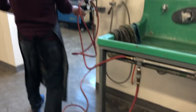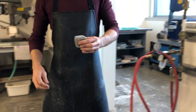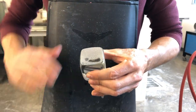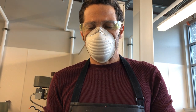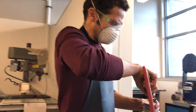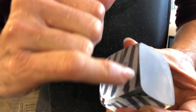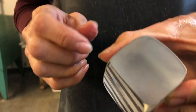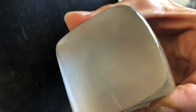I'm going to dry it off and show you. You can see I've almost ground down to the shiny glass — there was a little dimple in this surface. Now I want to bring up one other thing. So far all these corners are rounded edges because I haven't ground far enough down on any of them. But over here I have a very sharp, crispy edge. If you look really close, you can see a little black line there — that is because I beveled the edge of that corner. If I don't do that it will chip. You can see some tiny chips on the edge of that glass.